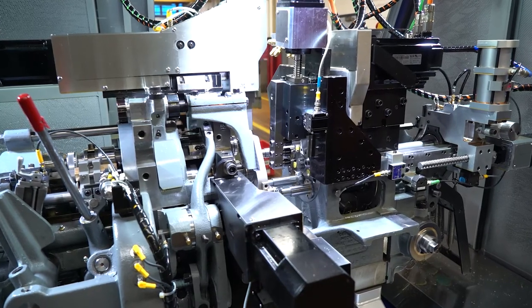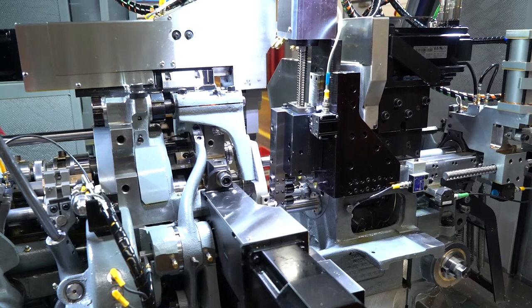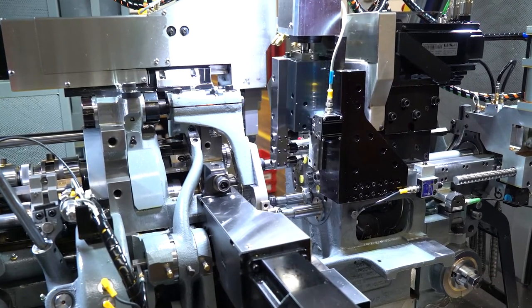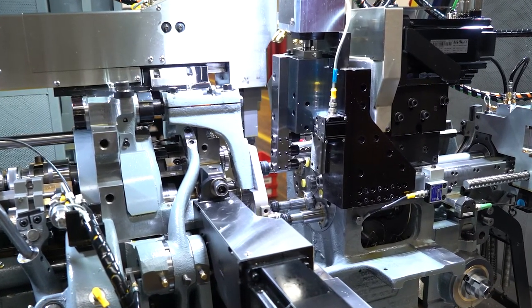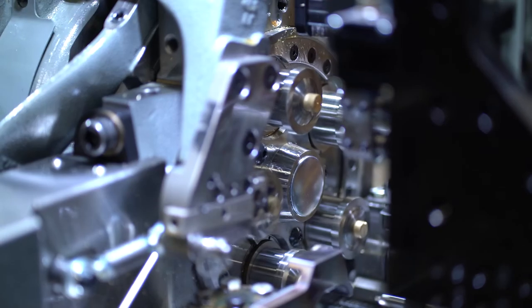The hybrid only has four remaining cams, so there's reduced time in not having to change out multiple cams. No more having to adjust collet dogs to the precise opening and closing points — it's all done digitally with the servo pickoff spindle. When setting up an existing job, all these parameters are saved.